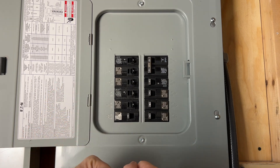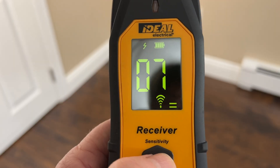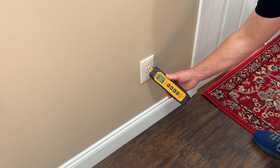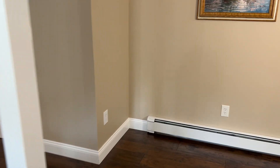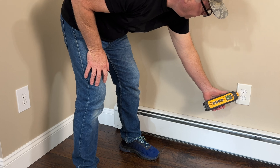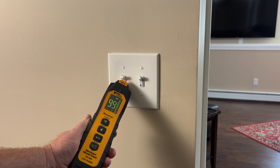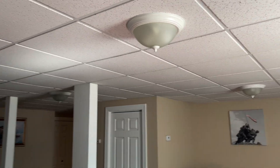What if we wanted to find out what else was on this circuit? We'll turn the breaker back on and drop the sensitivity down to level three. The receptacle on the right is clearly on the same circuit, and so is the next one over — both pegged the receiver at 99. Checking the ones on the other side of the room — no reading at all, those are not on the circuit. How about these light switches over here? It looks like these two light switches are on the same circuit. Let's shut off the circuit breaker to find out if we're right. The lights are clearly off now, so we are right.